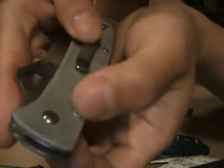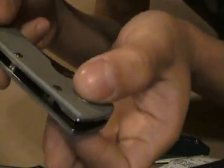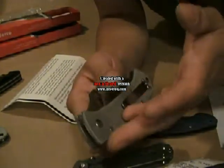This screw near the pivot is going to need Teflon tape, or Loctite, and so is the one right here, the pivot. So these two are the ones you primarily have to worry about. This one's the loosest, and this one can come loose. These, not so bad. But that's one of the things you have to be aware of. If you want to Loctite it, that'll make it permanent. You don't have to worry about it anymore.